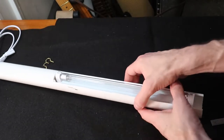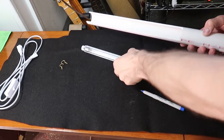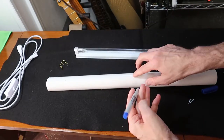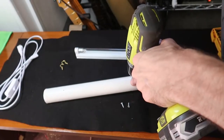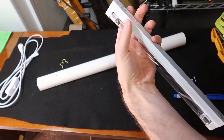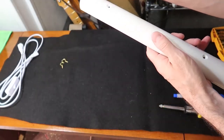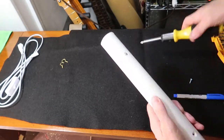There's only a single wire running in it, so we're not going to damage anything. It looks like a half-inch screw will do the job here. You want to put the lamp like this and leave a little bit extra at the top. I'll mark some screw holes here and go ahead and make some nice screw holes — just countersink these so the screw doesn't stick up. Go ahead and drill a hole in the bottom. Let's put that screw in and make sure the hole is lined up. Countersunk nicely there.